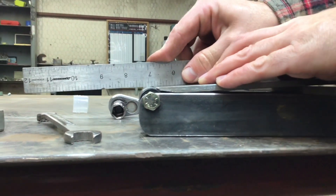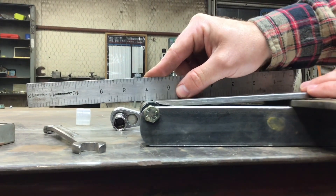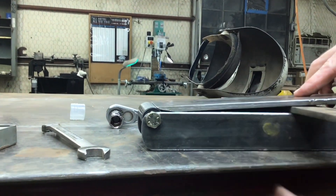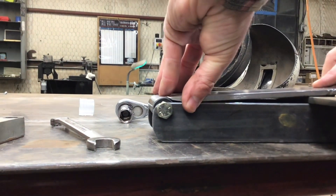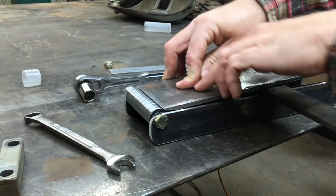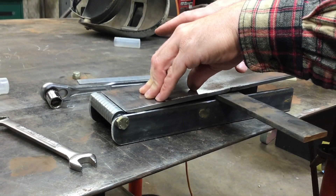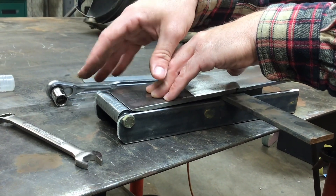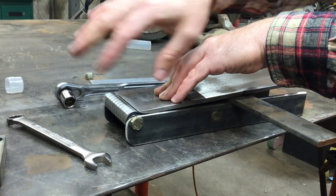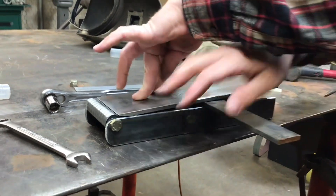We made it a little past flush, which is good. We can let this relax a little bit to where it's going to be perfectly flush. We're going to run this up all the way until it's touching the bearings and then just back off a hair. So we're set up — all we need to do is tack it. If you're a welder, just tack it in a few places and don't just go to weld them because it'll warp this thing. We want this plate and the plate on the opposite side to stay parallel with each other because these bearings are squared up against them. Just tack it a few places and we're going to add some support on the inside so that these plates can't move.